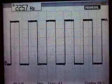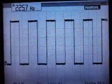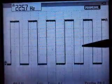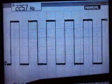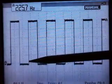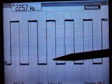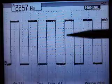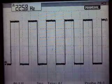Here we have a video on using cursors to measure voltage. This is a typical Hall effect switch. If we look at our scale, we're at one volt and two milliseconds, so if we just used our graticules we could measure the voltage — one, two, three, four, five — so it's a five volt signal. But if this was something we needed to measure precisely, there's a better way.